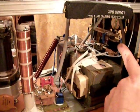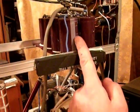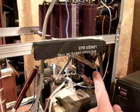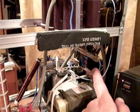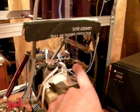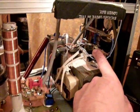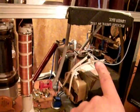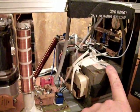The power supply is managed by a halogen bulb of 500 watts, shorted during the transmission time. In the moment where the PTT is pushed, the capacitors are charged through this halogen bulb, and one second after the PTT is pushed, this relay makes a short circuit on this bulb and the high voltage transformer is on full load.